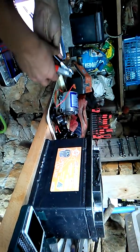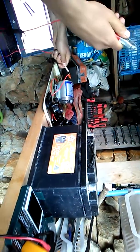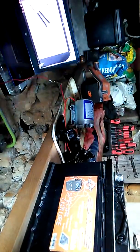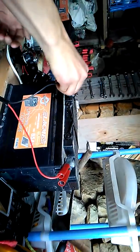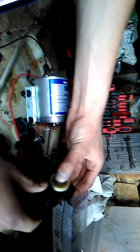And so we put it back together and everything worked, which we can show you. We have a big car battery just to test things on, and I made a makeshift way of clamping it to the pump terminals. So we've got the red one clips onto here. This is quite bad with crocodile clips, but that's all we had. And the other one, not a very secure connection, but it's only for testing. Then positive terminal and negative terminal, and the pump works. And you can see if you press the diaphragm, it turns it off, because the little switch turns it off, which is nice to know.